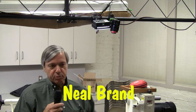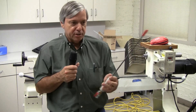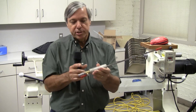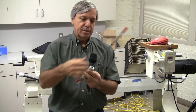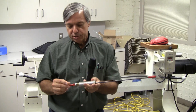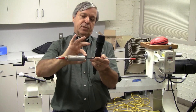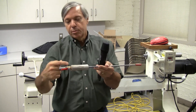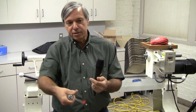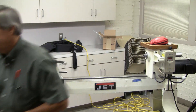When making hollow forms or anything where you want to drill in to get the depth, you can use a regular drill, but you have to drill a little bit, pull it out, clean it out. You can also use a gun drill — you can buy one from Amazon for $20 or less. There's a hole through the center that normally pumps oil through with metal. What you do is hook air to it. I took a piece of aluminum, drilled it out, epoxied it in, put threads on the end, added a valve, and now I can turn the air on and off. When I want to drill I just push it in and it goes right in — you don't have to pull it out until you get clear to the bottom. Very fast for drilling.